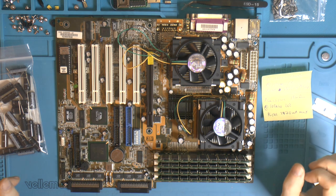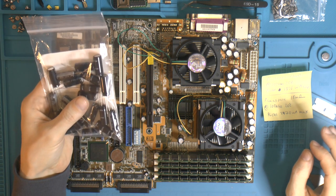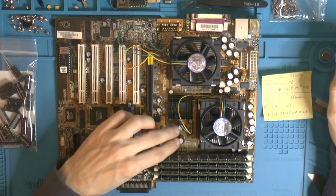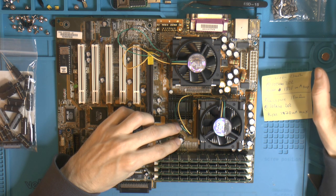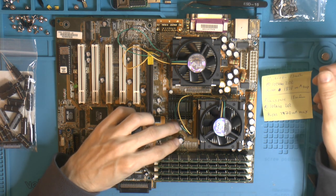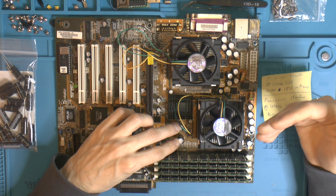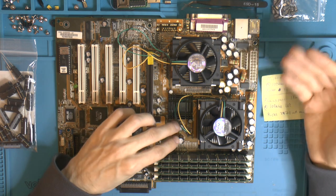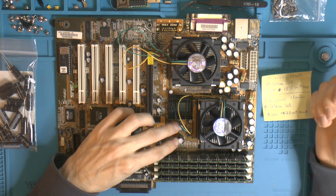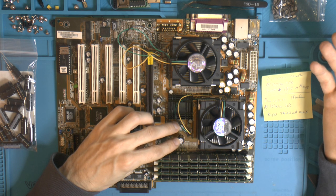I'm no expert on that, but I did look these up and I bought some new ones, pretty much the best I could get. These old Nichicons are rated at 23 milliohms, at 20 degrees C room temperature and at 100 kilohertz frequency, so that's basically charge and discharge. A VRM running at, say, 100 kilohertz would have that impedance apply. So at 100 kilohertz and 20 C, which is a fairly normal point, they give you the spec of 23 milliohms of resistance.